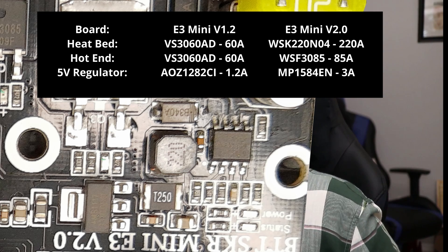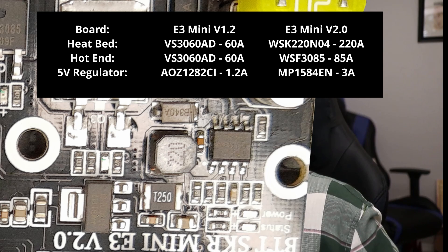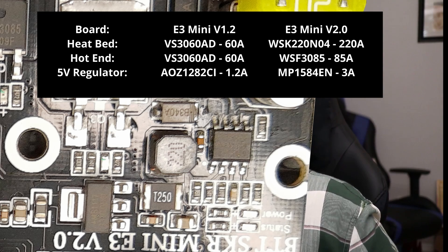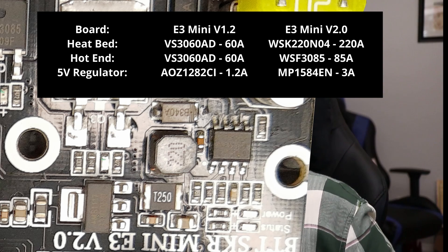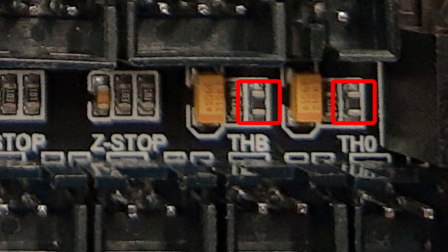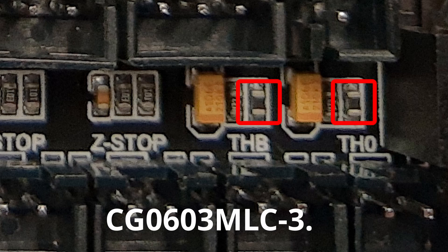The increase results in smoother power provided to the BL-Touch and reduces the risk of brownouts of the 5-volt DC bus. Brownouts can cause stutters in prints, inaccurate BL-Touch measurements, and flickering of the LCD screen. The large increase in power overhead is a much needed addition as more peripherals are becoming available for 3D printers. The clean power improvement continues with a replacement of the ESD suppression component — the filtering capacitor has been replaced with a chip guard component designed to better protect the sensitive electronics on the board, helping increase the longevity of the steppers and microprocessor from surges.